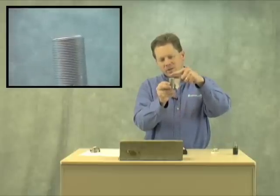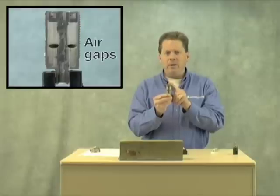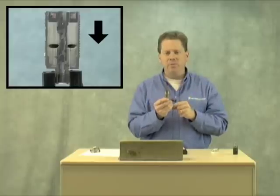We decided to see how some of our competitors would fare in our hammer test. This particular model didn't fare so well. If you look at the sensing face, you can see that it's sloped down to the right — it actually collapsed after a couple hits with the hammer. When we cut the sensor open, we found that this particular competitor didn't have full encapsulation. The problem was this plug here: once the sensor got hit, it moved. As the plug moved, the board cracks, then the core cracks, and your sensor latches on.